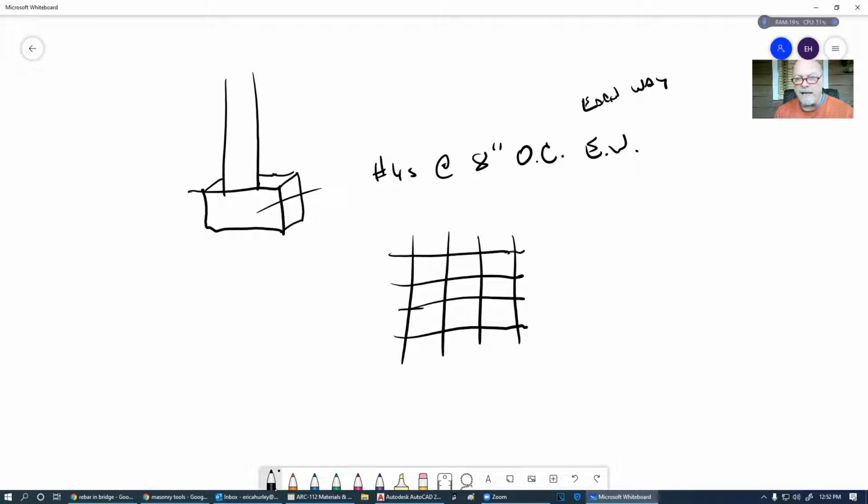And these will be tied, and this just goes across the bottom. So we'll have them going in both directions. It looks like just a mess there, but anyway. So this is generally about 3 to 4 inches up, 3 inch being minimum. So we don't want to go bare minimum, 3 to 4 inches up from the bottom.